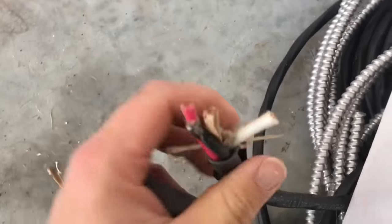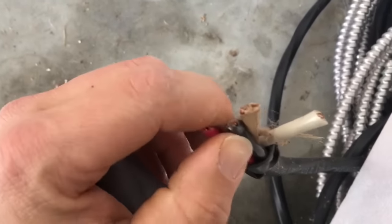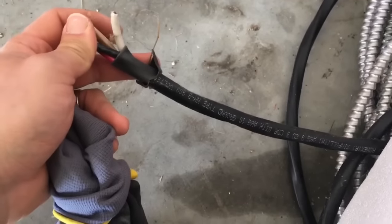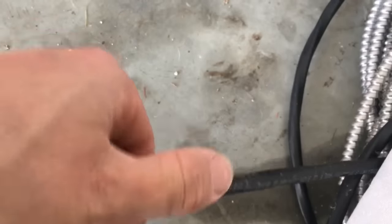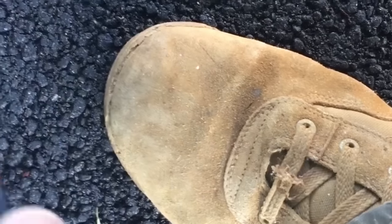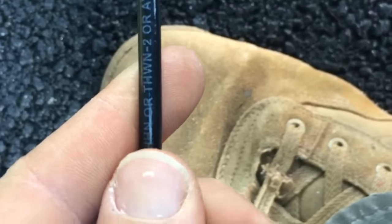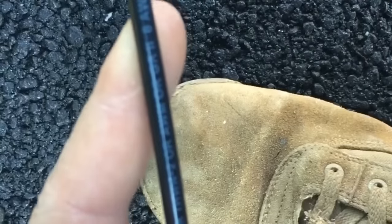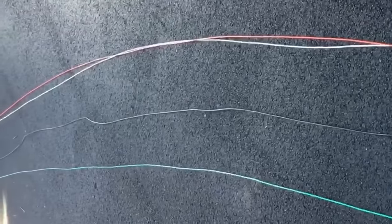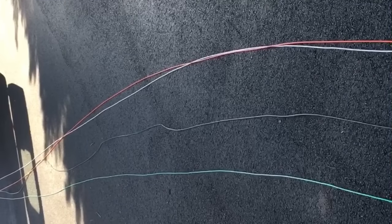Last-minute pointers: this is number eight, 8/3 NM-B — a lot of people call it Romex because that's the brand, but this is the kind of wire you'd use to wire a house. The reason I'm not using it here is that when you have these wires bundled together in a cable like this, they can't pull as many amps. THHN — which has a couple of different names — is what we're using, number eight THHN. The good thing about THHN is you can call your supply house and tell them the lengths you want, always get it a little longer, and they'll cut you the different colors. It's usually cheaper at a supply house and it saves a ton of time compared to buying a full roll and spooling off individual pieces.